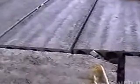On the second floor area, all the hollow core has been put into place. The joints between the hollow core have not yet been grouted. These will all be grouted first, and then the entire upstairs area will get a 2-inch skim coat of grout to create a power trowel level concrete floor surface.